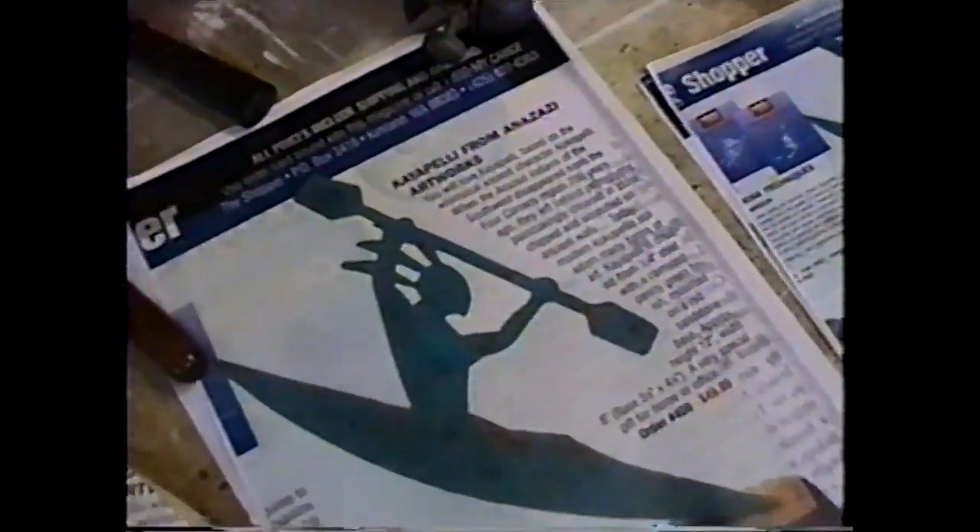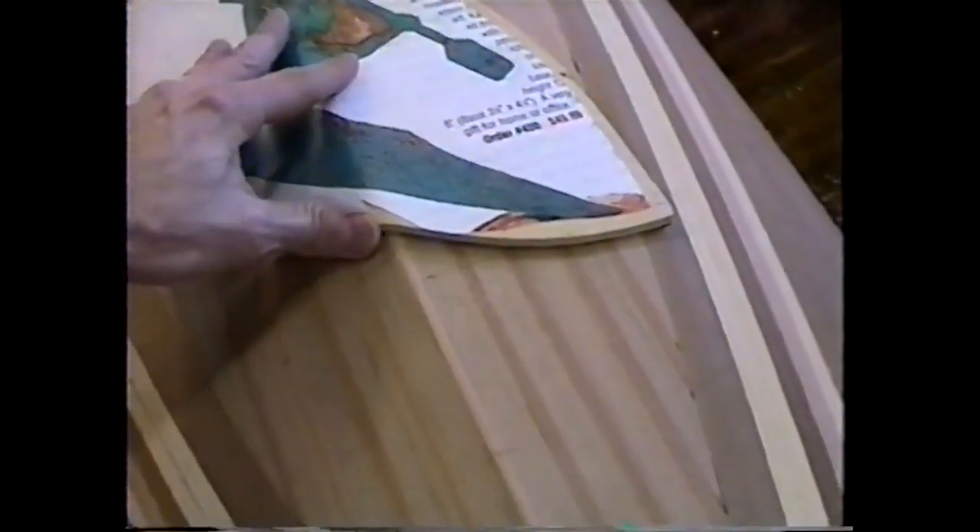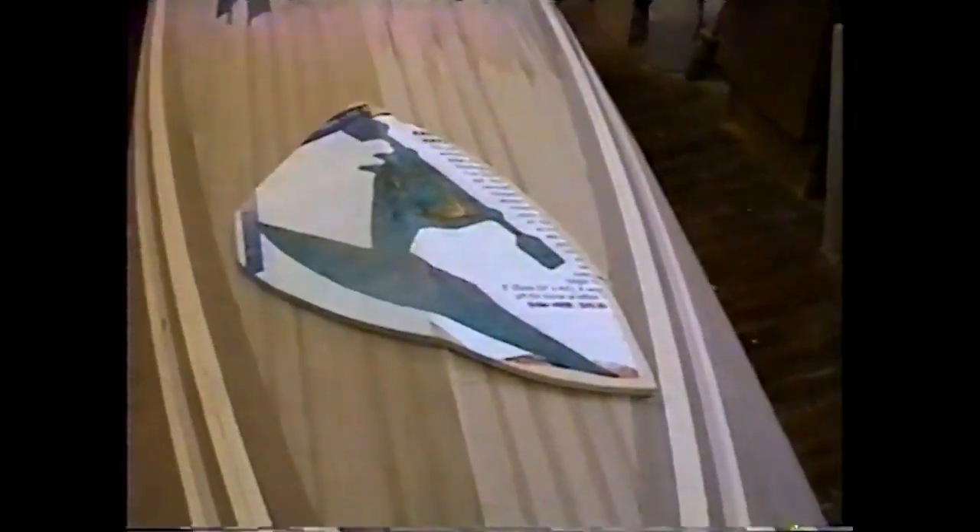You can see I've already started filling in the white sections — here, here, here, and here I've put in pieces of dark wood. You can see it better from the back. All I've got to do is take a coping saw, cut out the design, then cut a matching hole in the deck and put it in. And then I'll have a strip-through design — a lot easier than if I tried to strip the design as I stripped the deck. Should work out.